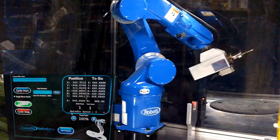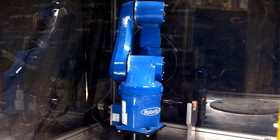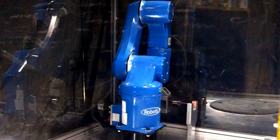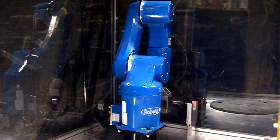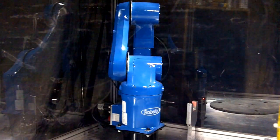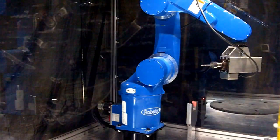The robot will then go into the tool pre-setting routine to measure the length and width of the tool to dictate the correct tool path for the part being cut. The robot will come from one direction and take measurements, and then flip the spindle around to take the other side as well. This double check allows us to ensure the best accuracy possible for the tool being used.